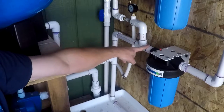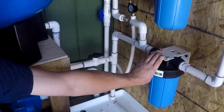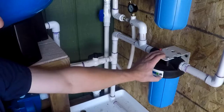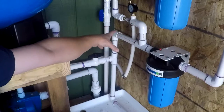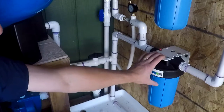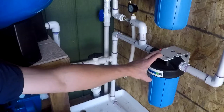Fresh drinking water comes into the first filter, which is just a pre-filter to remove large contaminants — anything over five microns. If your tank has a lot of debris going into it, you'll need at least two pre-filters. If the water is excessively dirty, depending on severity, you might want a 50 or 20 micron filter, or a mesh filter followed by the fine filter. Their water is very clean, and it's been several months and the five micron filter still works fine.